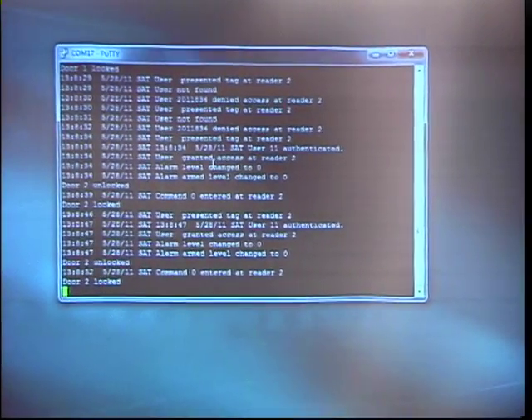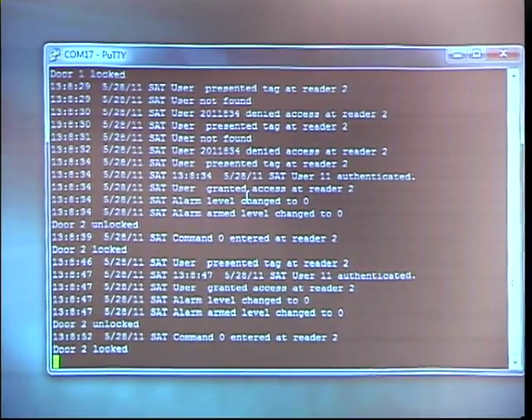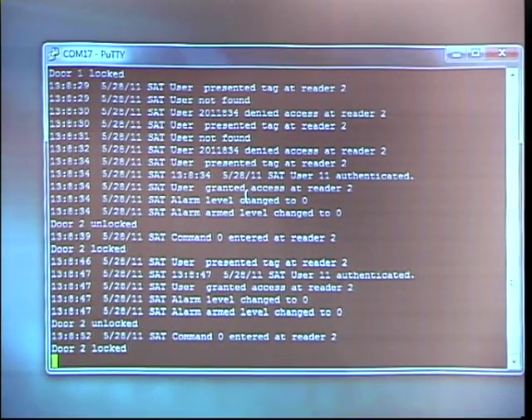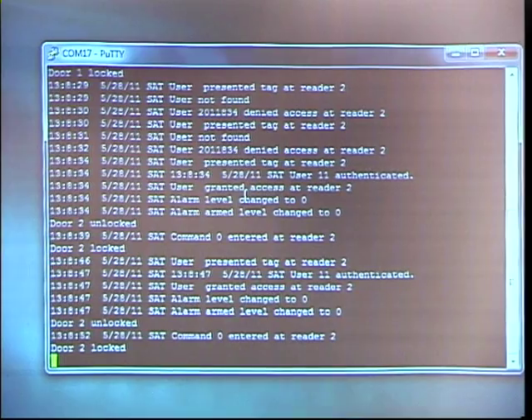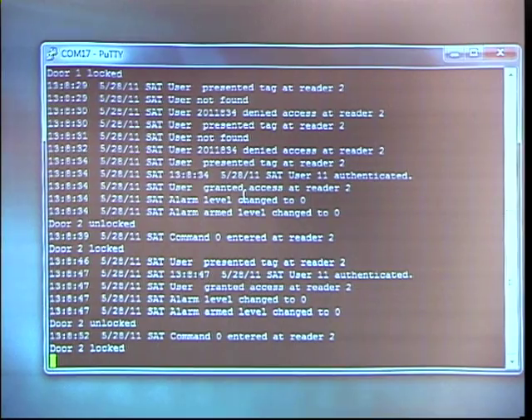While we've been doing that, we also have been logging this. So this is our serial logging. It's really simple — just 57 kilobit serial over USB. We can send that into a Linux log host that tails the logs. We have some scripts written up that are published. They let you do things like pipe that to an alerting system or email or SMS you when someone comes or goes or an alarm happens.